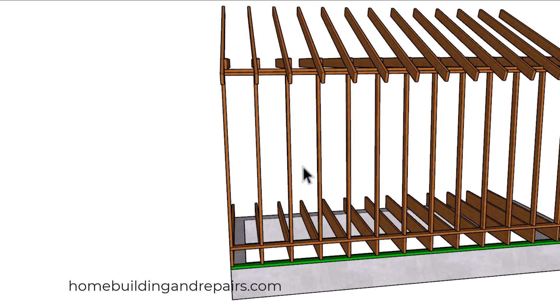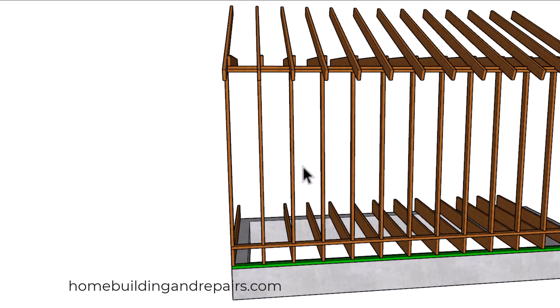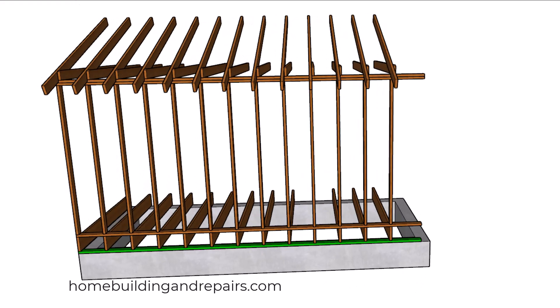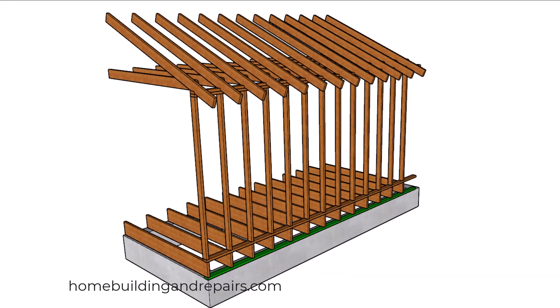In this diagram here, we're laid out at 16 inches on center. All of the components line up perfectly, except for the ceiling joist. In a situation like this, you can lay the ceiling joist or the roof rafter out on top of the stud. I like to lay out the roof rafter on top of the studs, because that's usually going to be the most weight.